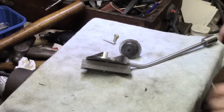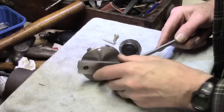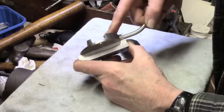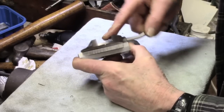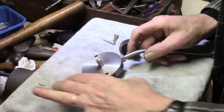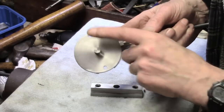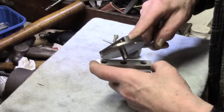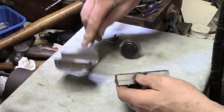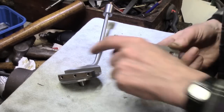Back to the ball turning device I made recently, which has a little bit too much float on that swivel. I've drilled a couple of holes through there so I can get through to the set screws for the T-nut, because whatever I'm going to do down here is going to make the T-nut part of the swivel.